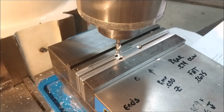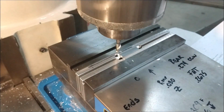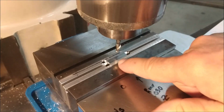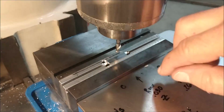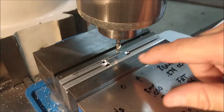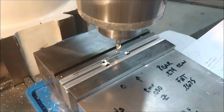With one end of the part successfully cleaned up, like I said, zero out the digital right now. X-axis. Make your shift. Be very careful that you don't overstroke the Y-axis cut and run your cutter into the jaws. Stay within the confines of the aluminum shim. The thicker the shim, probably the better. Excuse me, the wider the shim, the thicker the better.